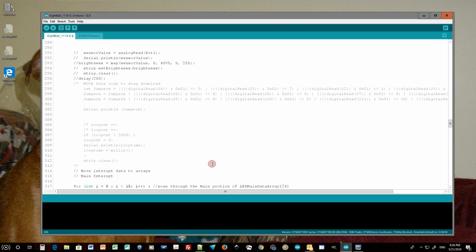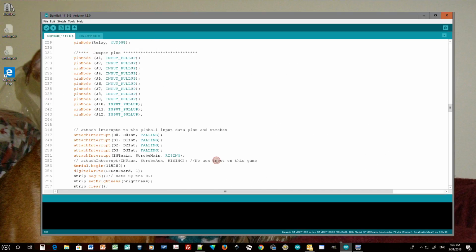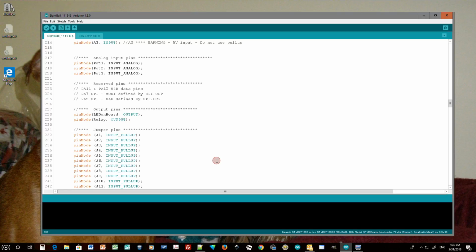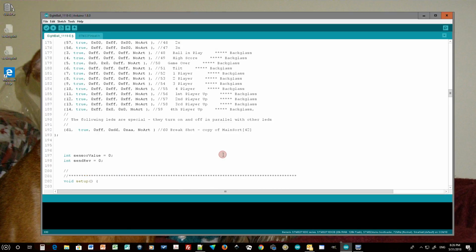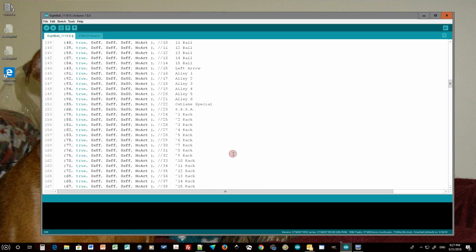The other problem with the, whatever you call that channel on the right where the light was stuck on, I believe that is caused by the switch being pushed down and stuck down, which causes the pinball machine when it starts up to say, the rollover has been rolled over, advanced to the next position, but then it never comes back up, so it never lets it reset. And so it just sticks at that point. So we will fix that. That's a mechanical problem, I'm pretty sure. There doesn't seem to be any problems in the code for that light.